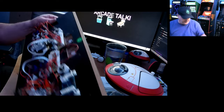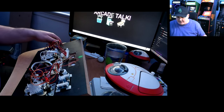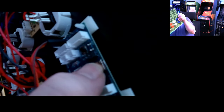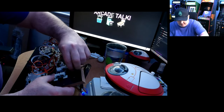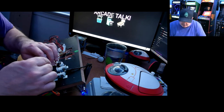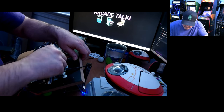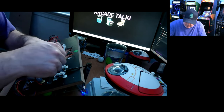Connect the USB cable to the board — there's a little silver connector on the board where it attaches. Then take the wiring harness cable and plug it into the A slot on the board. Make sure these connectors go in the correct way — there are little grooves on the connector that align with slits on the board slot.